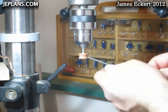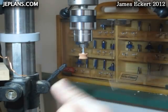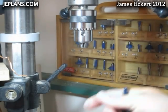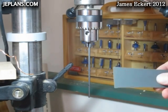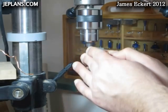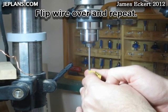First we're going to round the ends a little bit. Just going to put it up against the stone and spin it to round the ends. Now we're going to put the crankshaft right in the drill press. What I have here is some 2,000 grit sandpaper — I'm basically going to just polish up the rod with it. You don't want to end by going up and down because then the shaft will actually move back and forth in your engine as it spins.